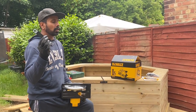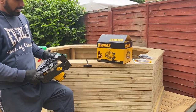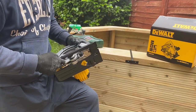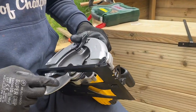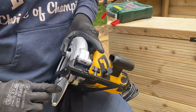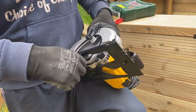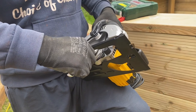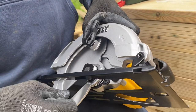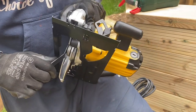Now, how you can open the tool - open the bolt with this spanner. You need to hold it, otherwise this is just moving. So, to stop moving this, you need to press this button. Press this button and now you can open. Otherwise, look - I just tied it again because I loosened it already. And now if you try to open, the motor is moving. If you stop rotating the motor, then just press this one, because this is why they give this option. Because if you change the blade, the motor is not going to move.